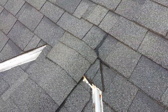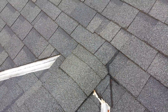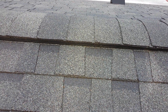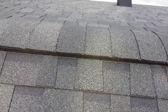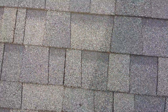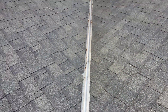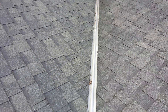This cap and top shingle here is done incorrectly. If you look at the ridge vent, it doesn't have an outside baffle, so air and water can be blown into this exhaust — especially when that power fan kicks on. If it's raining, it draws water right into that ridge vent. And if you look at this valley here, it's just poorly done.